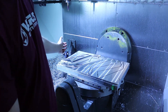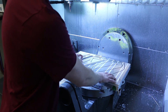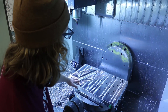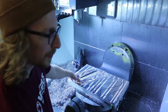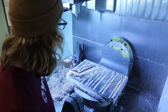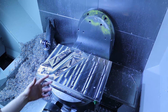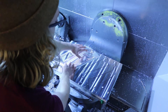The chuck stays on here for pretty much any vacuum application, and then we have these removable fixtures that are specific to whatever program we're using. As you can see right here, Op. 1 is complete on the high-efficiency wing uprights. Basically, this is a hybrid type fixture — we've got two fasteners here, some mechanical work holding to give us a little extra holding power, so we're able to rough quickly, while still getting the benefits of all the atmospheric force from vacuum work holding.